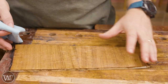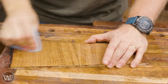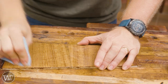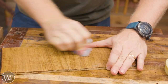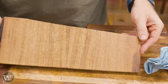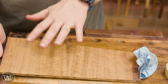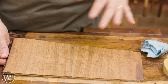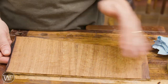After letting this sit for about an hour to harden, I come in with a rag, wad it up, and buff the finish in. This takes off anything sitting on the surface — any oils left that aren't fully absorbed — and works everything into the pores. You get a really nice clean surface, almost like a French polish, but it leaves a very natural look to the wood. You can see how the color naturally comes through: it has a much more flat finish but still has that little bit of gloss when the light hits it. This is not a once-and-done finish — I usually come back and put a little more paste wax on once every six months to a year, which brings the finish right back.